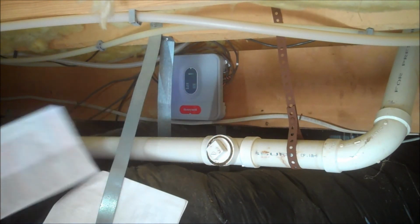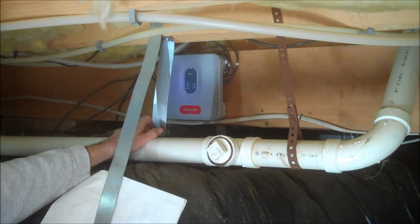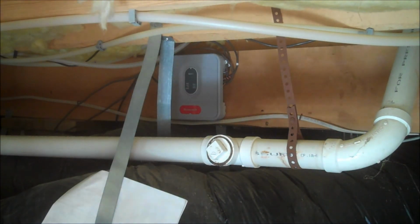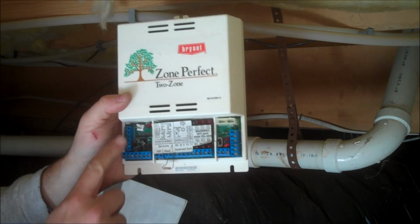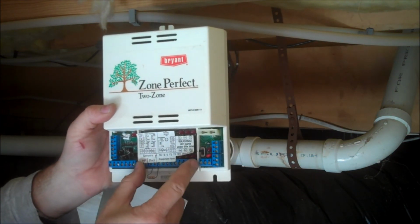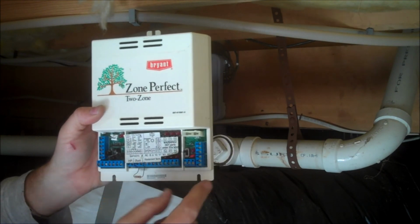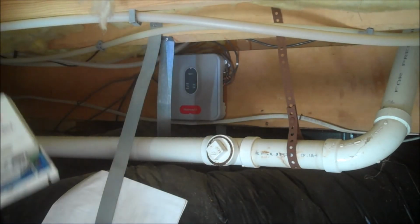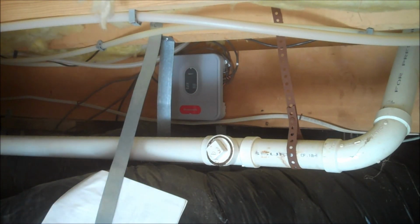Okay, we installed the Honeywell zone control. We just rewired it based on the previous wiring diagram. You can see we had zone 2, zone 1, the main wires to the package unit, damper 1, damper 2, rewired those back up to the zone control per the instructions, and now we're just going to cut the power back on to see if it works.